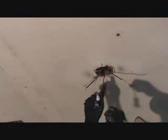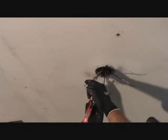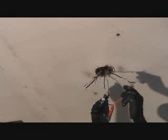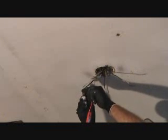Alright, now here's my first black and white. I can see, remember we had these 2 wires screwed together, a white wire and a black wire. Okay, taking those off. I'm going to test this, and sure enough, look at that. There's the orange light. This is the hot set. Now if I put my wire tester over here, this should not be hot, and it's not. And this should not be hot, and it's not.